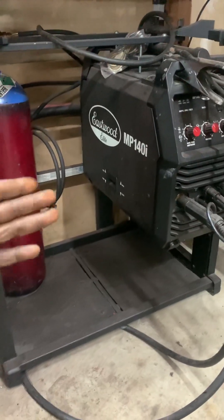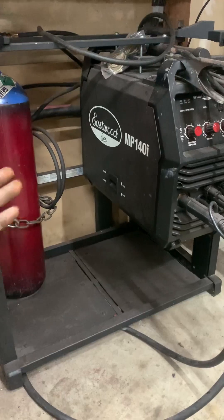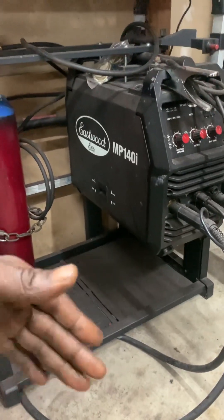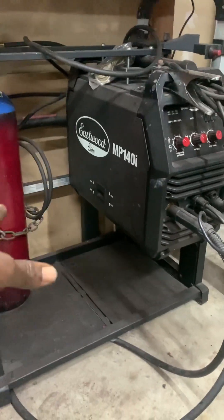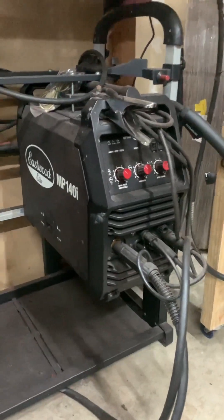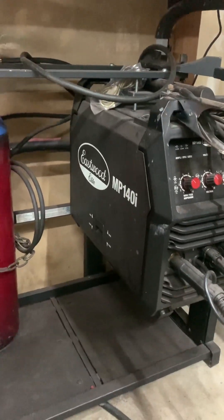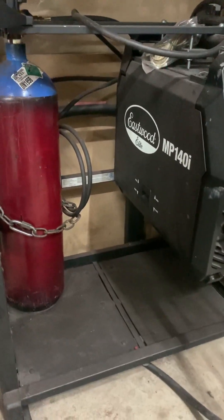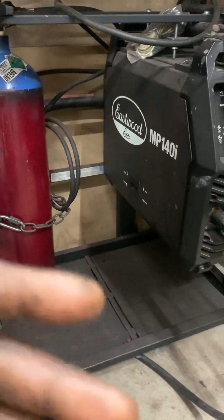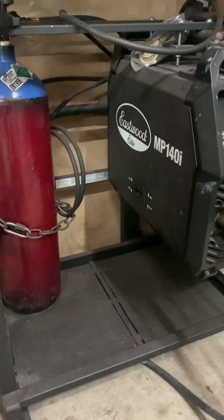If you look at your actual manual that came with your unit, you'll see that they most likely recommend that you have a dedicated 20-amp branch for your welder. So a 20-amp outlet — you have to understand the basics of how an electrical circuit is laid out based on what the outlet is and where your breaker is, etc.